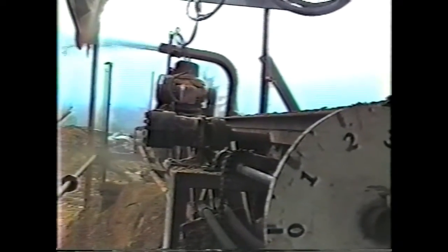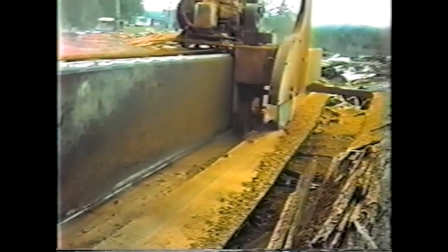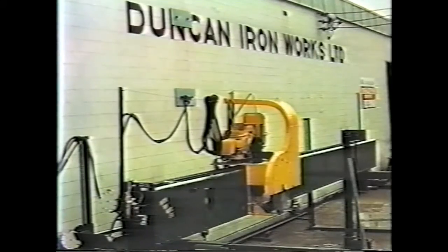Provided is a discharge chute for the head saw to transfer as much chip or sawdust as possible away from the log deck. All the critical operations are run through chains and sprockets for accuracy of the cut and for ease of setting up the operation. From dismantle to reassembly is not too difficult to do in one day. Although the saw is portable, there are sites where the saws are being set up in a more permanent operation.